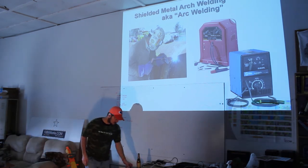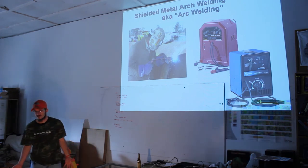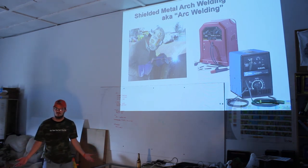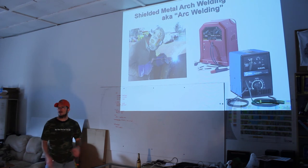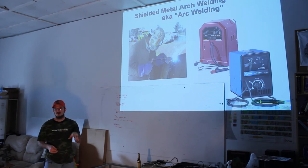About what makes TIG able to weld aluminum, because I can't find a TIG welder advertised as aluminum capable for less than $1,200 or $1,400, and I'm like, why? Well, one of the things I kind of got a basic concept of is that it alternates the current, not so much in a sine wave as a square wave. Okay. A square wave with slopes to it.